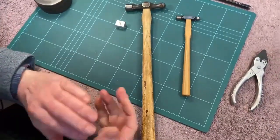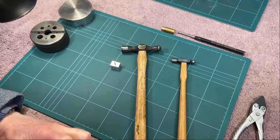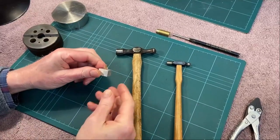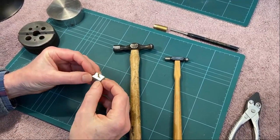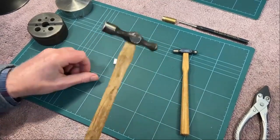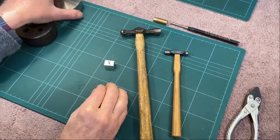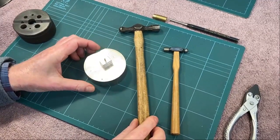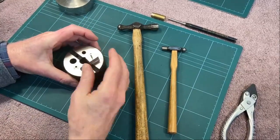Let's start with hammers, because we all use hammers, but in my view they're used rather too often, certainly in working with O gauge. We'll take an example here — I've made a large one so we can see what's going on — a pin that needs to be pushed into this aluminium block. This could be a piece of etch and a much smaller piece of wire of course. The temptation for many people would be to just knock it in — not really the best way, and certainly not on a springy surface like this. Something underneath with a bit of weight to back up would be a good idea, and if the pin is going to go all the way through, something with a bit of weight and a hole in it so you can knock the pin through.